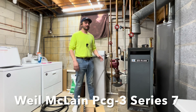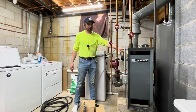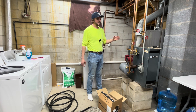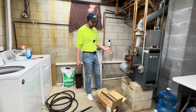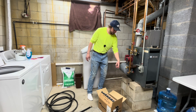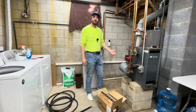This is my boiler. It's so old that when I call the company and tell them the serial number and the series number, they have a hard time finding paperwork on it. Ever since using this boiler, it's always popped and done what is known as kettling. It may have a lot of scale buildup inside. We're going to be flushing it out and replacing the expansion tank as well. I tried to get air pressure from it and tested it with a gauge — I was unable to build pressure, and when I knock on it, it sounds like it's full of water. So I don't believe the air pocket is still there; if it's there, I believe it's compromised.